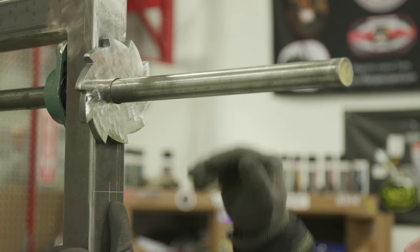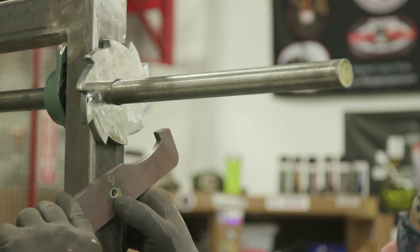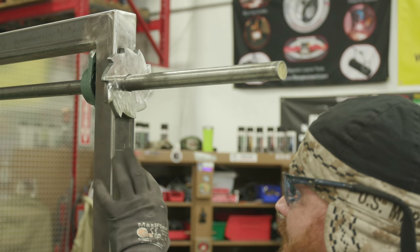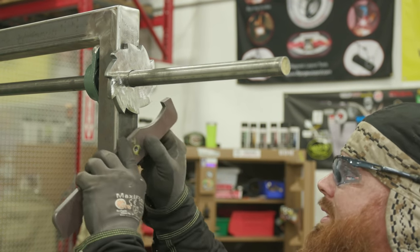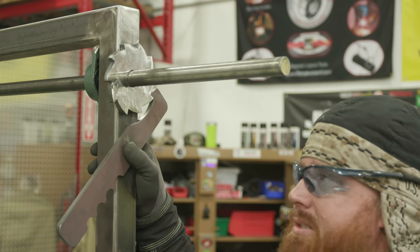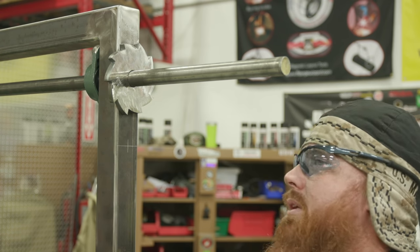So right now I came down 8 3/4 inches because that's about where I determined this is gonna be a good fit right in there. And then I just centered that tube. I'm gonna hit it with a center punch, through hole it, and then I'll go ahead and mount this. I'm gonna get everything mounted, and then before we go to paint it, we'll probably start taking the mechanical fasteners off piece by piece. And then that way we can get everything painted and be good to go.